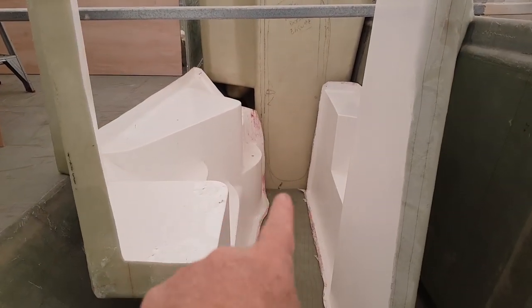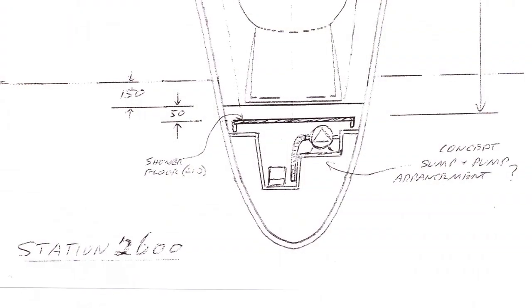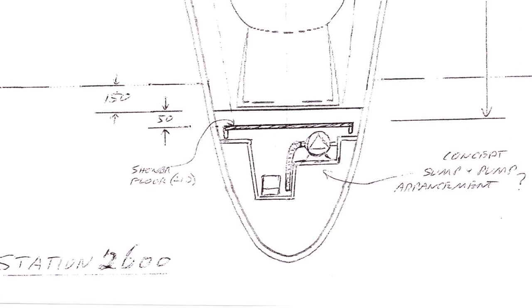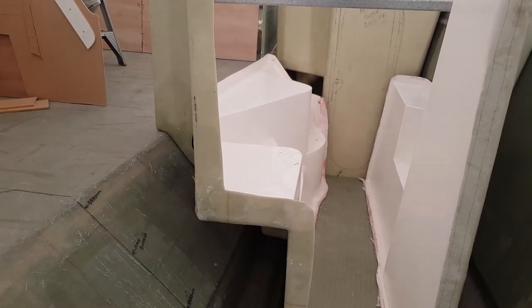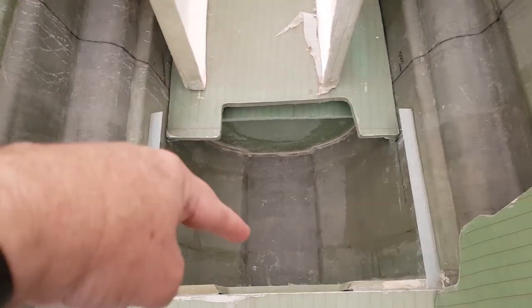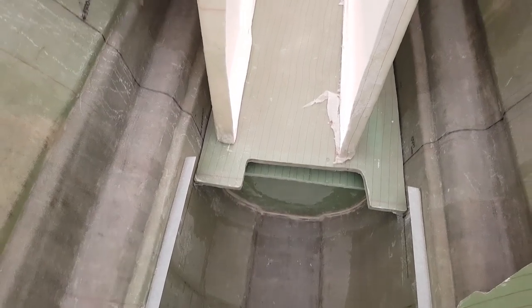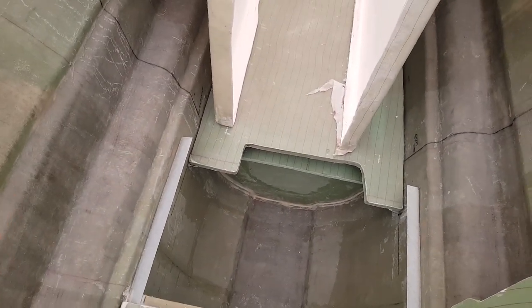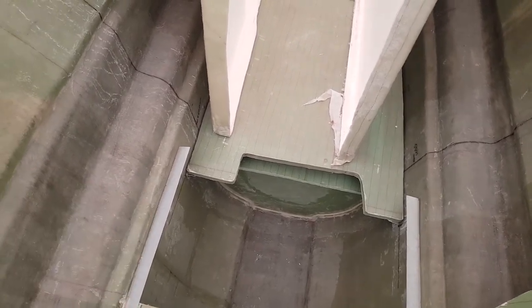Yeah, that's right. It's been a very complicated morning. We've had a couple of hours of this and we're nutting stuff out. And the other thing we've come up with is down in the head, and I'll show you a photo of it, there's actually a sump, and we're going to run the washing machine, the sink and the shower all the way into one sump with a bilge pump that's then going to pump it along here to my black water tank, which is right here, black and grey water tank, all in the one system, just like a house where we keep all our plumbing together into one spot and simplify the whole thing with a Y valve so that if we're out to sea, we can flush the whole lot out to sea.